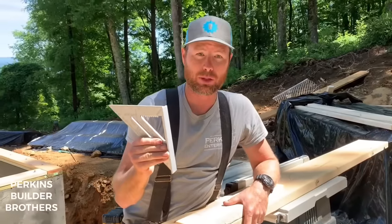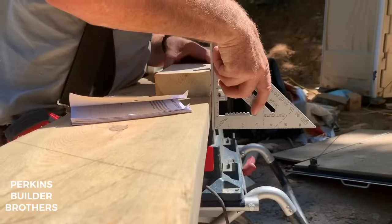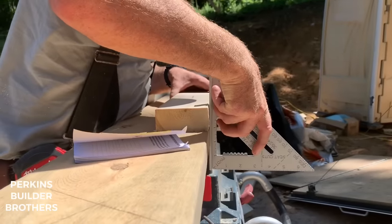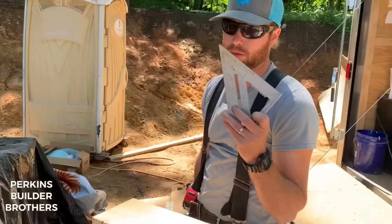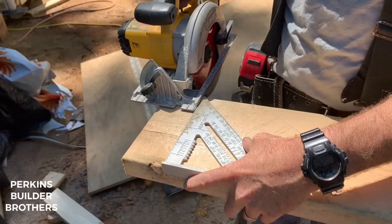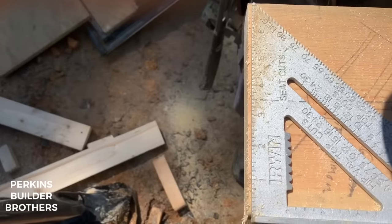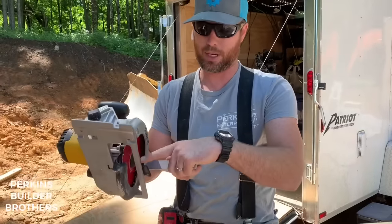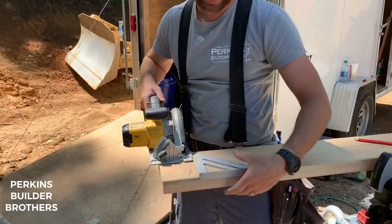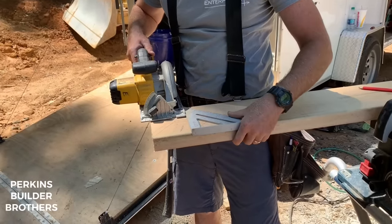Another way I commonly use my speed square is to flush boards on top or bottom — using it in this manner to make sure when I nail two boards together they're flush and not slightly offset. Bump until it's tight, nail it. You don't have to draw a line; just give yourself a nice straight edge. Then get your square to run the base of your saw on it. Make sure your fingers are out of the way — don't hold your square close to the blade, hold it way out here. That's actually the better place to hold it anyway.